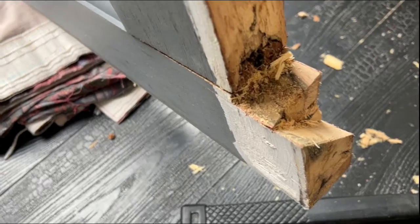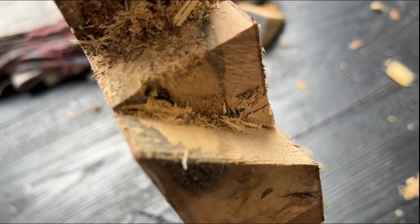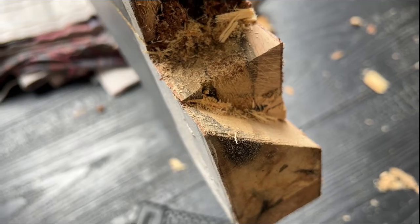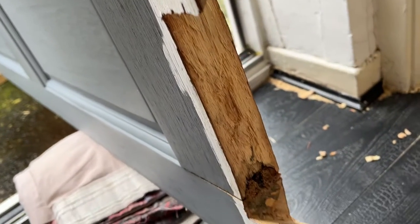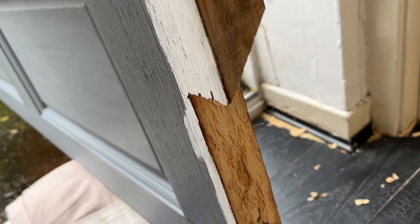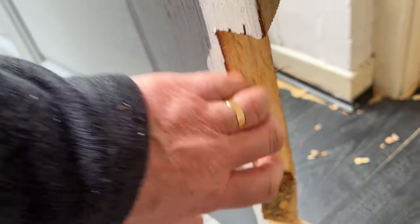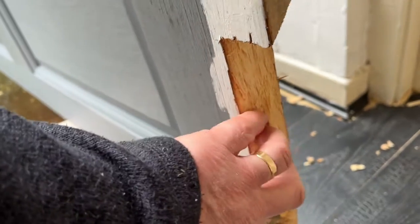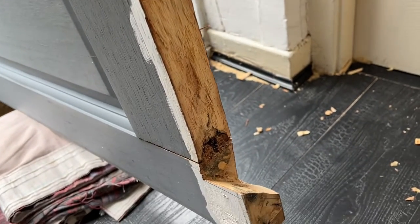and of course there's always going to be a rusty screw just where you're trying to cut the mitre. Whilst I was able to cut the upper mitre pretty much on the line, that rusty screw really messed up the lower mitre. Although it feels dry to the touch, some of the timber is still a bit soft, so I'll try soaking some wet rot hardener in before fitting the new repair piece.